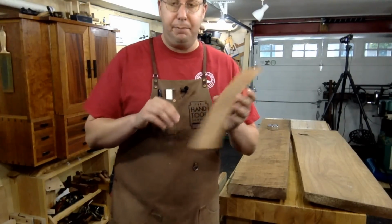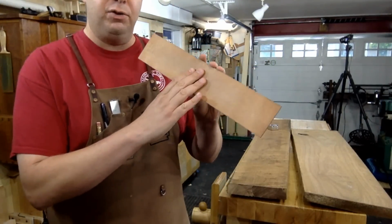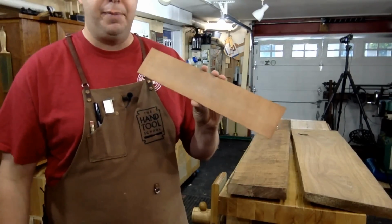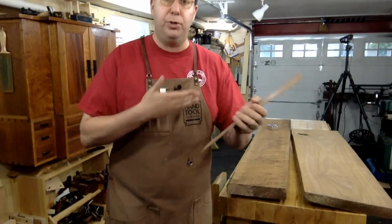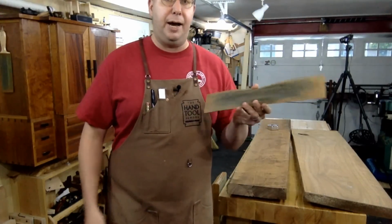But most importantly, because there's no compound, because it's super smooth, I'll flip it to the flat side and remove the burr, and you'll actually see the little metal line from the burr come off. As you know, if you can get a burr, you've reached the edge, and then you pull that burr off and you're perfectly sharp. So technically you don't even have to use compound on a strop.